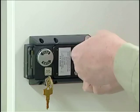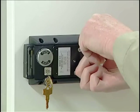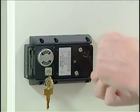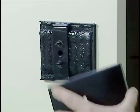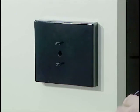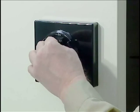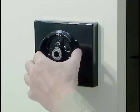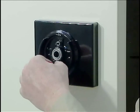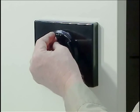The studs should line up with no problem. Tighten that screw — I've already got three in place — and then we'll go back and check that each of the others is tight as well. Now we can put the cover over the exterior drill-resistant plate. It's time to take our 2740 lock dial ring and loosely attach it over the two studs that extend from the drill-resistant plate. We've got two lock washers and two 8-32 nuts that will thread onto these studs.